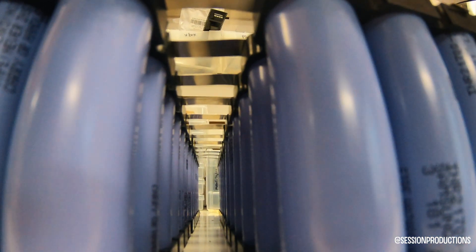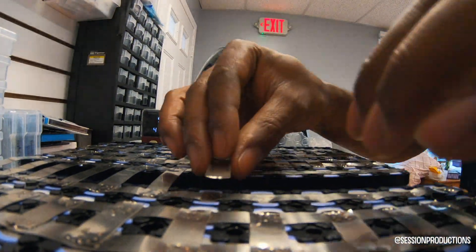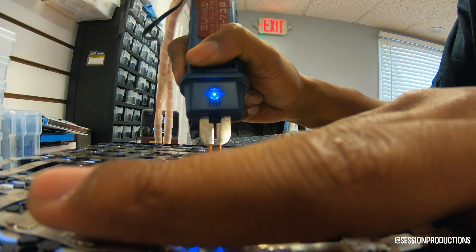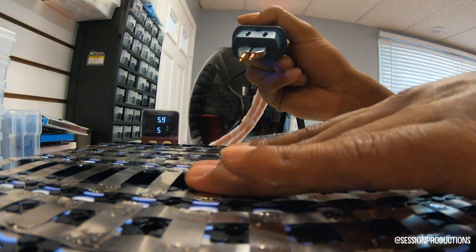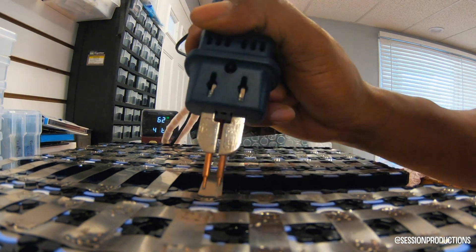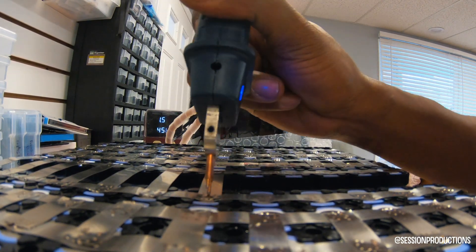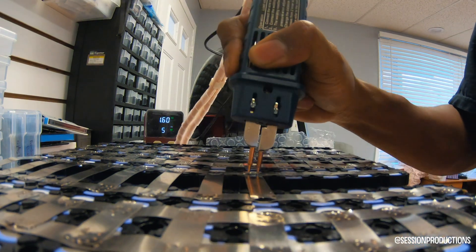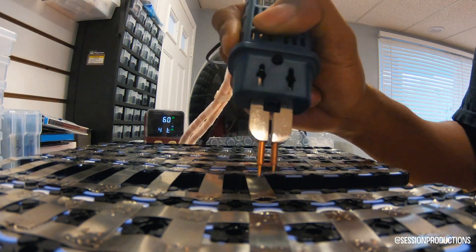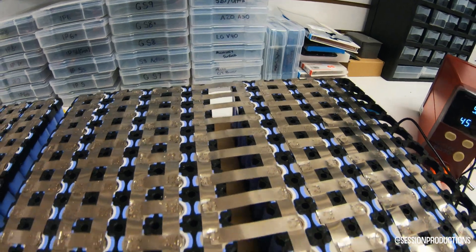As you guys can see, I just finished one series — in total that's 48 volts right there. You want to bridge only one side — do not bridge the other side, that is bad news bears. Now we're working our way down to the last set of bridges to connect the last pack. This battery took me maybe eight to ten hours cumulative time just to get to this point, and this is only part one — we still have to hook up the BMS, clean it up, and solder the power lead wires on.